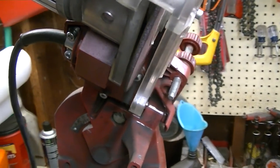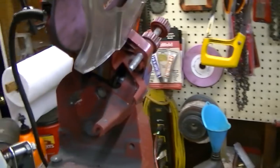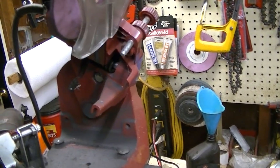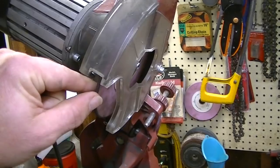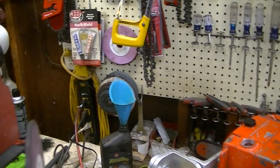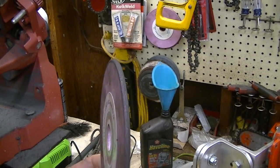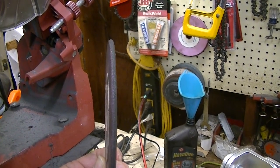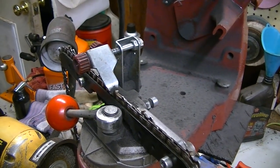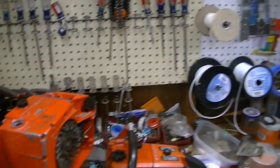Let's look at other details. The rounded edge — these come with a template, a little plastic gauge, and of course a dressing stone. I've found if you flip the wheel every couple of times you use it, it tends to wear evenly and I have to redress these very little. This is the 3/16ths wheel, which goes on for 3/8ths and .404 chain. This is the 1/8th for 3/8ths low profile, and I usually use that for .325 chain as well.